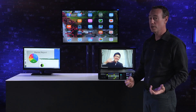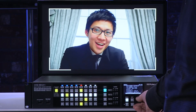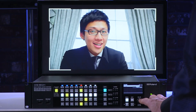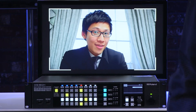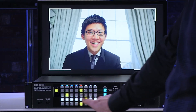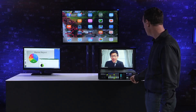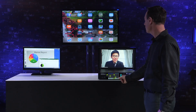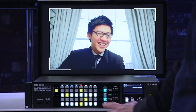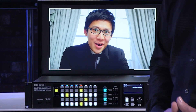Because of the powerful features of the XS Series — scaling both on the input and the output — I can make sure all my video resolutions match before and when they go out to the screen. Let's look at some of the other program preset modes. Program preset two mode provides two program buses. Program preset three mode gives three output buses plus a preview bus. There's also a mode with two preview buses and two output buses. These are fantastic modes for live presentation production.